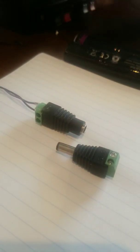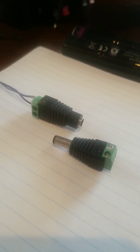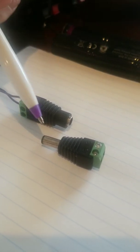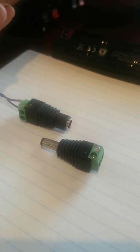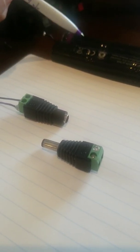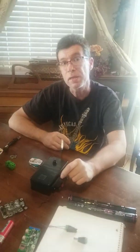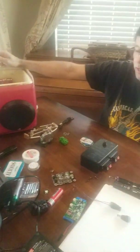Another thing, these plugs here. Males, females. You can get these off Amazon. They're closed circuit TV accessories, 2.1 times 5.5 millimeter plugs and receptacles. That's what you search for, 2.1 times 5.5 closed circuit TV receptacles. These plugs are what I'm putting in play between here to hook up batteries in series to parallel them to run these. And I'll go through that more.